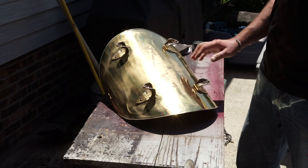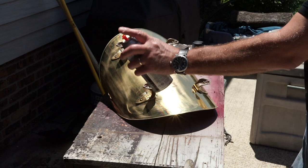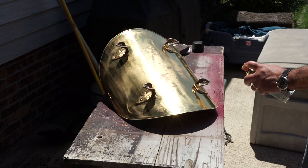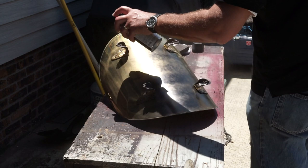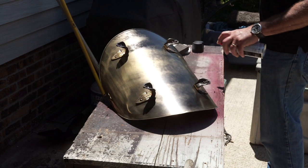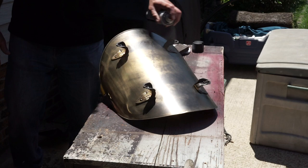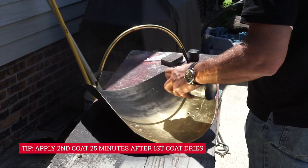We're going to start with the side you don't see so that you can actually practice a little bit. I'm going to use short sweeping motions where I push the trigger and then as I come across, I'm going to release it. You don't want to go too heavy on metal — when you're painting metal it can run, so you really want to put light coats on there to get a nice finish. Whenever you're spray painting, move around the material so you can make sure you're getting even coverage throughout the whole thing. Change your angle so you cover everything. Light coats — I'm not spending a lot of time holding it on there, because if you do that, that's where you get paint runs.